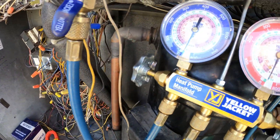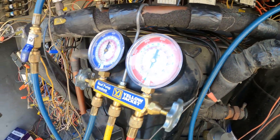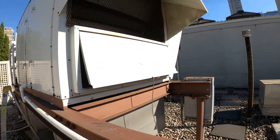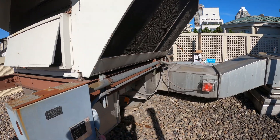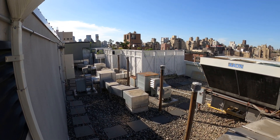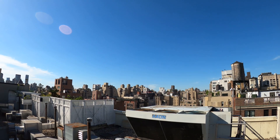We're pulling a vacuum, and we're going to see if this holds, then put the refrigerant in the system and start this thing up. I would like to put a micron gauge on this system to really see if we get all that moisture out. That was the service call — got a leak. If anybody found this video interesting or helpful, please drop a like, comment, and subscribe, and I'll catch you all next time.